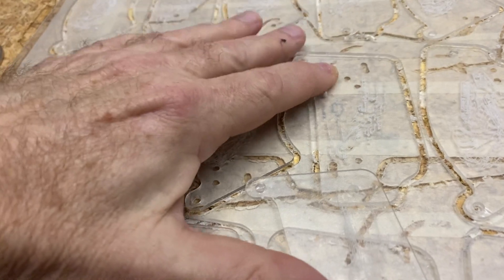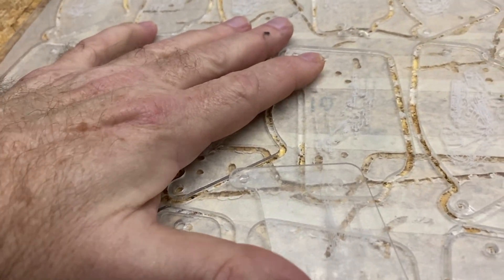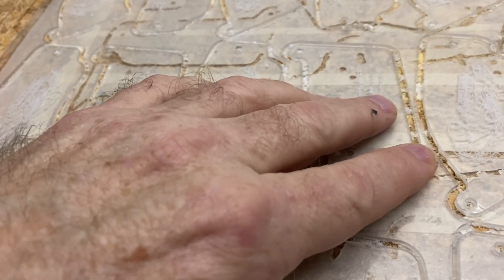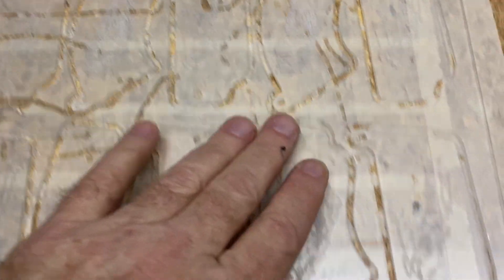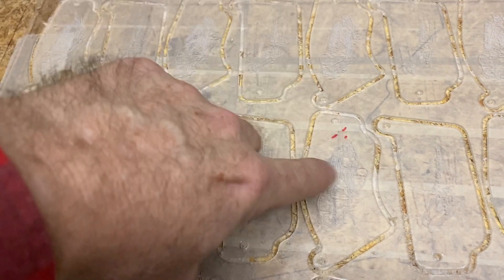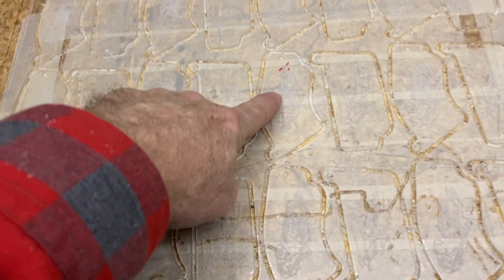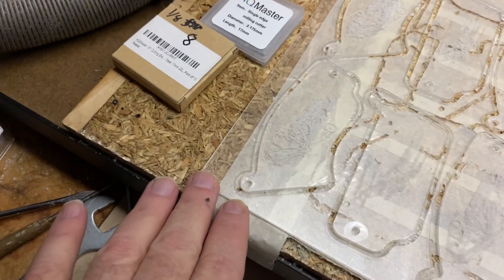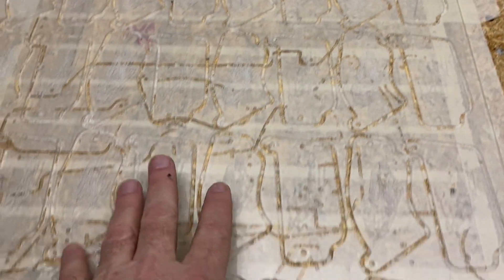You're going to have your hand within an inch or so of the scary dangerous spinning bit, so be super careful. It wouldn't hurt to have one of those gauntlet metal gloves like some chefs use so they can't cut themselves. I made one mistake where I hit the Y jog instead of the Z jog and dragged the bit. I zero my Z in the center of the sheet rather than one end, because that gives me more confidence that the average of the board will be right — I've zeroed out at one end before and not cut through at all by the time I got to the other end due to temperature and humidity changes affecting the board.